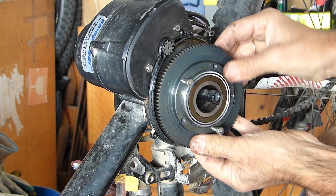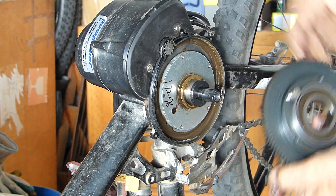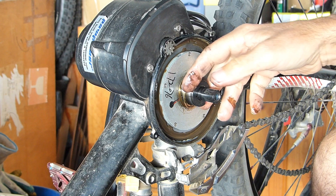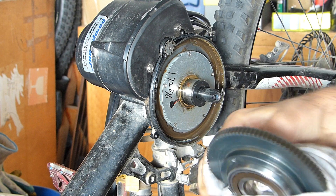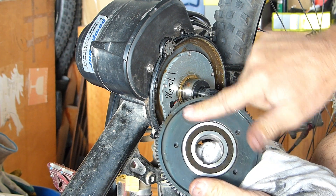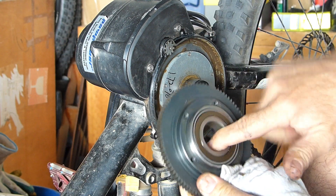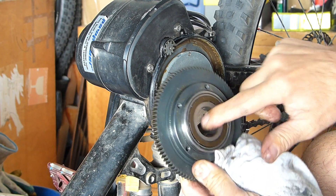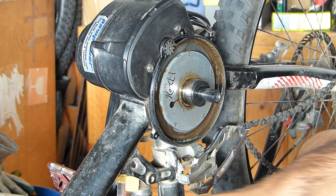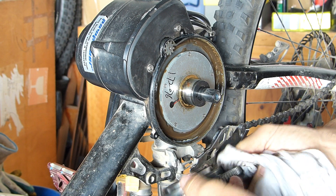There's a key — it fits into that slot there and into there. I'm not going to touch these washers. The bearing gets pushed flush to this face and it needs to lock so it's free to spin anti-clockwise, and it locks in the clockwise direction. Just make sure we get it in the right way. This solid gear — I think it will last forever.